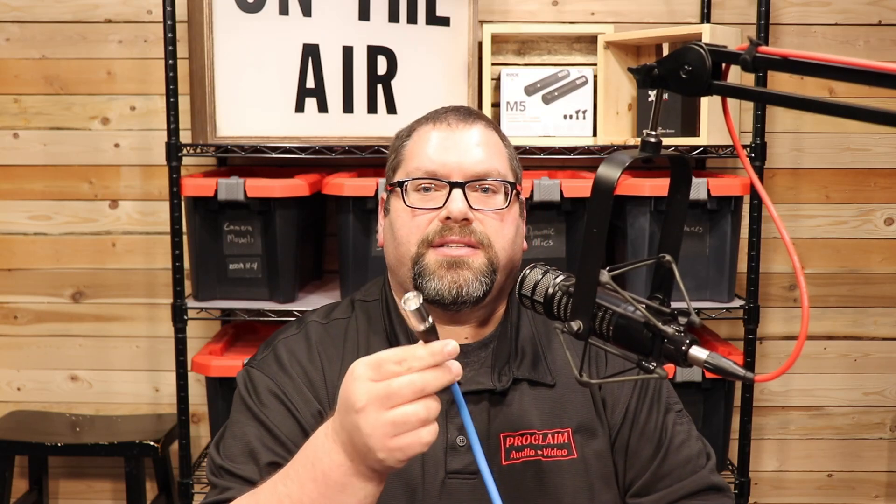I've recently run my own shielded Cat6 in my auditorium at my church, for two reasons. One, I'm adding four analog mic lines for Christmas. And two, a future digital upgrade is in our future. The nice thing about running a shielded EtherCon cable is that it's going to work with everybody's digital stage box that works with digital mixing platforms. Instead of four analog channels, if I start using it as a data cable, I could have 48 digital channels — or however many my digital mixing platform will allow — over a single Cat6 cable. For me, it's not only a temporary upgrade for an older system, but also getting ready for an upgrade to a newer digital system in the future.